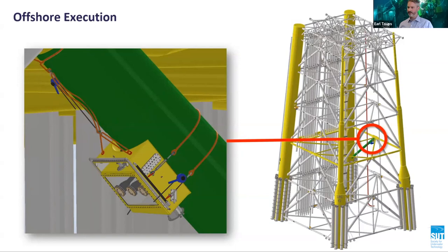The first repair to a relief slot in a 60 millimeter node. Secondly, a repair to the closure weld defect where the diagonal brace joins the node, transitioning from 60 millimeters to 30 millimeters wall thickness. And lastly, a repair to an access window weld situated just below the closure weld at the 6 o'clock position.